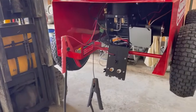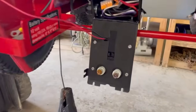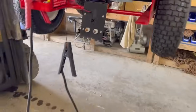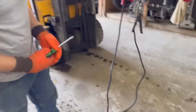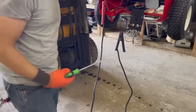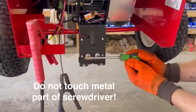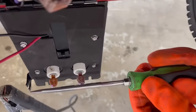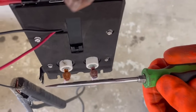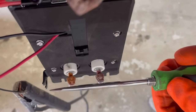Make sure your wires aren't going to touch at all and keep them away from your contacts. He's going to flip this unit on — again, be extra cautious, he's got rubber gloves, an insulated screwdriver, and rubber boots. This thing puts out 17,500 volts. You can see right there — hold the screwdriver out about half an inch and the arc should jump to the screwdriver. If it does, those contacts are good and the igniter is good.